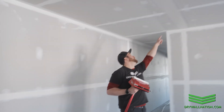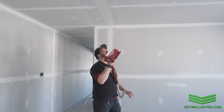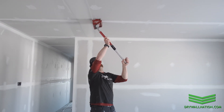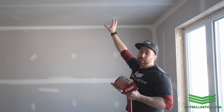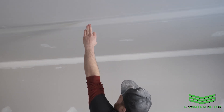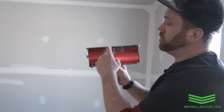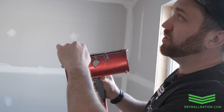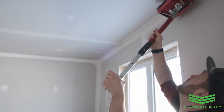We've already done our first long seam right down the middle of the ceiling. Now we're going to do our bevel coming into the butt joint. I ran this seam on setting number three — you can kind of faintly see the edges of the drywall. To me that's not really a thick enough coat, so I backed it off to two, which gives a little more concave and adds a little more mud.